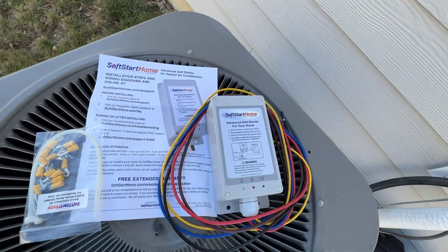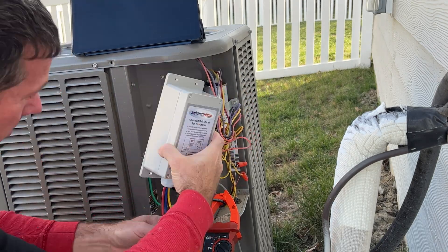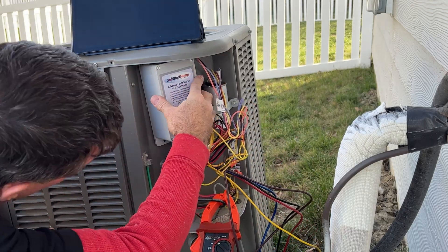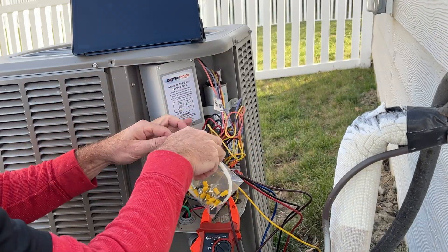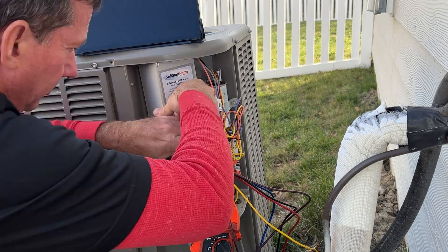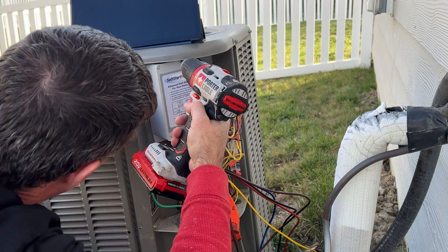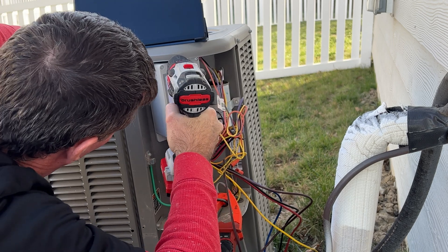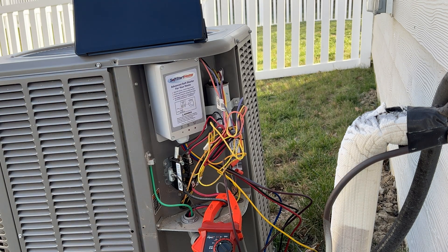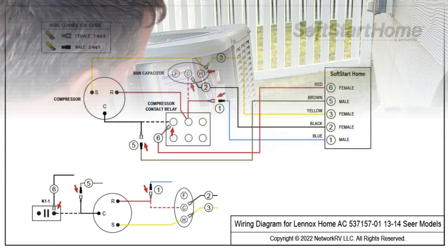In our kit we'll find some basic installation instructions and a bunch of connectors. I'm pretty particular about my installs — I wasn't able to get it exactly vertical because I had a wiring connector coming through the back plate, so I got it in as good a location as I could, while still providing access to the entire electrical panel. I also made sure there was no refrigerant tubing behind the back panel so we have a clean place to attach it.